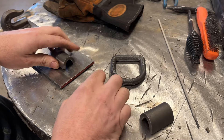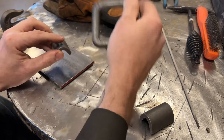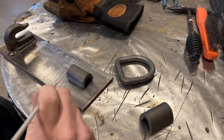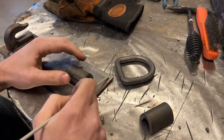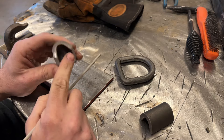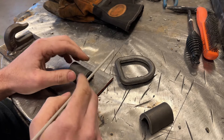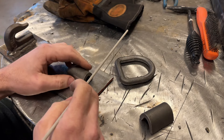There are a lot of ways to weld these. Make sure your D-ring is on before you tack it up. You can weld it with eighth inch rod or 3/32. The minimum number of passes relates to how thick this is - about quarter inch - and your base material. Being that it's quarter inch, if you're running 3/32 70-18s, minimum is three passes each side. If you're running eighth inch, you could probably get it done in two passes if you do a bit of a weave on the second.